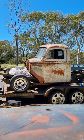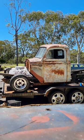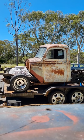Okay, I've just moved one of my subframe rails to the front of the car. And I'm just gonna see if I can slide it under the cab and on top of the chassis. I think there's plenty of room there because I've actually got to build cross braces on top of this. So I should have 50 or 60 mil or thereabouts of spare space to play with. So I'm hoping I can just slide it under, sit it on the mount points, put the mounts under there and do some measurements. Let's see if that plan works, eh?